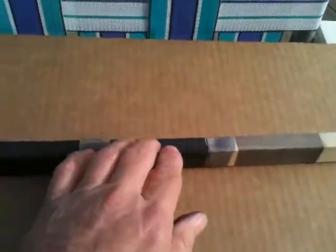One coat was not quite as even, not quite as much of a reaction. So two to three coats of the tannin powder, letting it dry between coats, then just one coat of the ebonizing steel wool and vinegar mixture, really made it come alive and ebonized it real nice. Now, because it's all water-based, it will raise the grain, so you have to take a little bit of care on that.